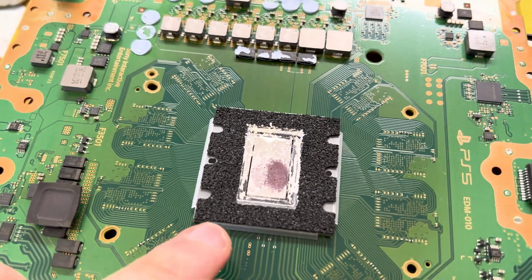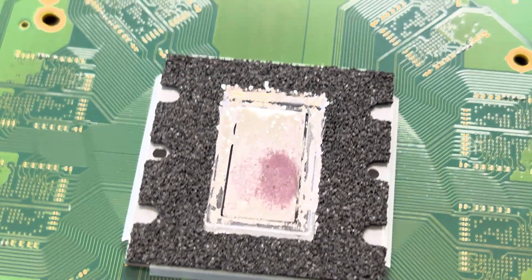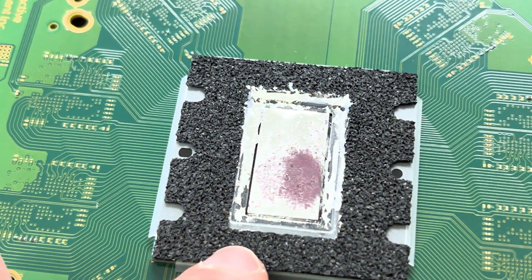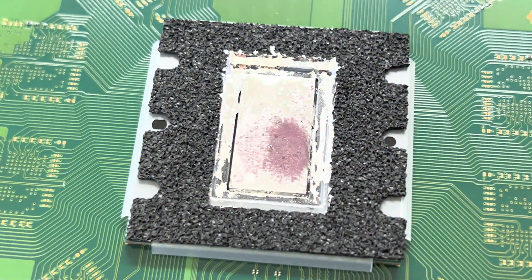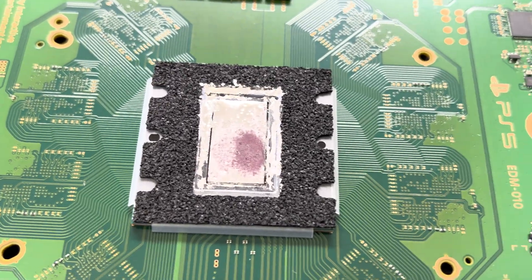It's always user damage when it comes to the Xboxes and you can see the damage externally. Another addition to my little mini rant - look at the size of that dry spot on the APU. It's quite big, almost half the size, doesn't have any liquid metal. Exactly the same on the cooler as well, and I can confirm that this PS5 hasn't been opened before.